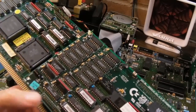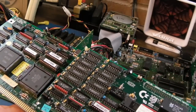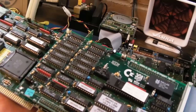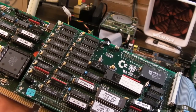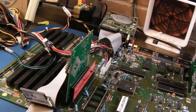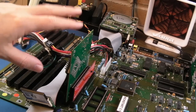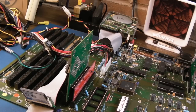I think I'll go and get the Janus software, because that's the software you need to get this working on the Amiga, and install it on the Compact Flash card I'm using. I'll probably try and do that in an emulation environment - I'm assuming WinUAE can emulate one of these boards. Because I haven't got the original disks, I might need to create them, maybe on the 1200. Get some blank floppies, create them on the 1200, and then I can have some install disks and try to install it on the 2000. I've also got some different CPUs and things we can try if we can't get it working.